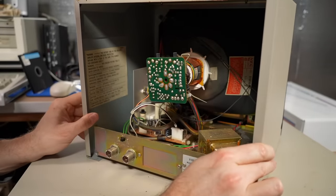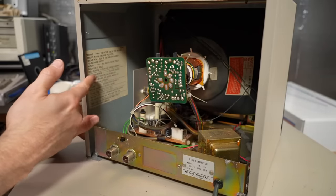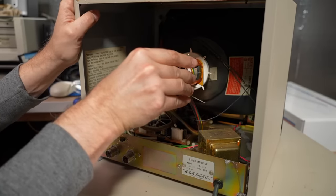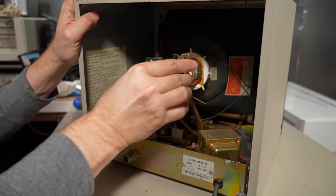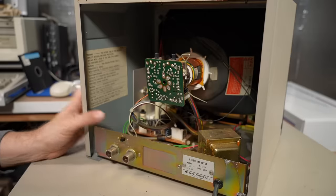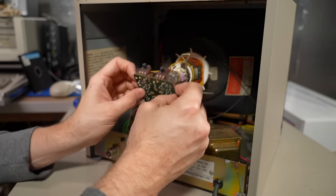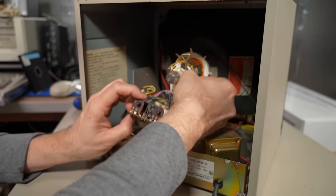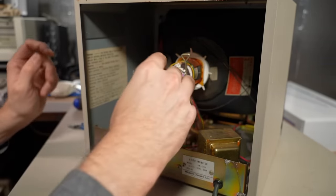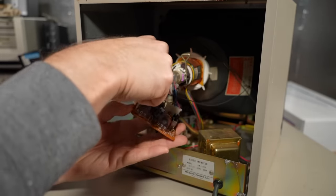This is a little bit different of a design than I'm used to. The CRT seems to be actually attached to this part of the metal chassis. So I'm going to take the neckboard off here — just wiggle that off. There's a zip tie holding it all on. Zip tie cut, neckboard comes off. It's a very crusty plastic zip tie. On this neckboard there is a ground lead that goes up to the CRT — we're going to have to unplug that. The deflection yoke is connected to the little PCB here, so I just unplug that.